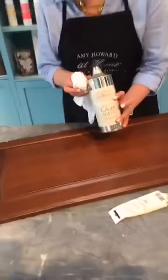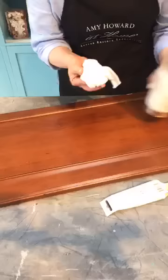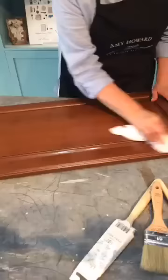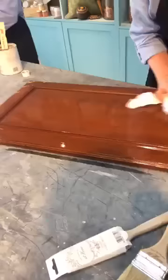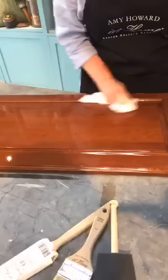So the first thing you need to do is you're going to take the clean slate, and basically this allows you to take off all the grunge, the grime, and the wax. So this particular finish is, again, the veneer that I just took off of that cabinet, and I want you to wipe over it really, really well and get all that wax and everything off. The good thing about it is that you don't have to worry about putting water back over it to get it all off. It's just gonna air dry after about 10 or 15 minutes and you're gonna be just fine. So I'm gonna come back. This actually wasn't too terribly dirty. I wanna make sure that I dry it just a little bit.